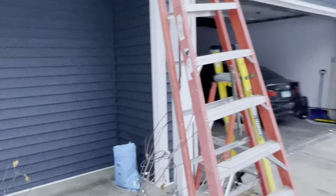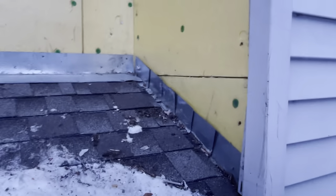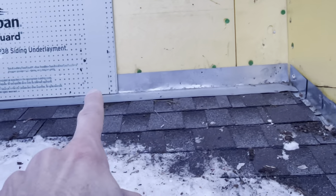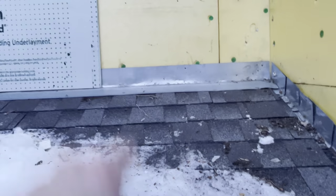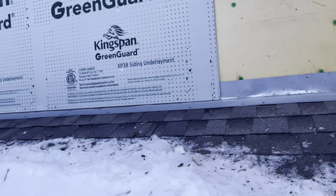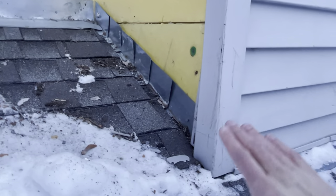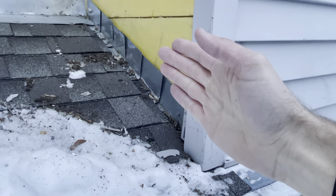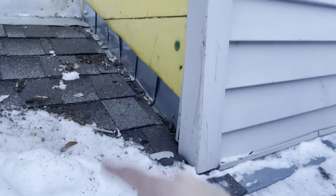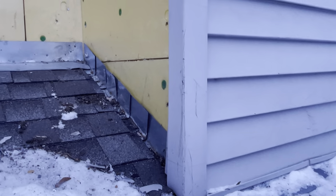One last thing - the dormer flashing and step flashing. The dormer flashing will tuck behind the siding and sit on top of the shingles - that's to flash the seam where the roof meets the wall so water doesn't get in. Step flashing: you've got a piece that goes underneath each course of shingling, stepping up as you go. The siding goes over top of that and it runs underneath the shingle about four inches. You've got to have those seams flashed - it's got to be there for a functional product.